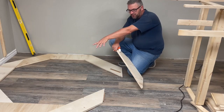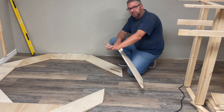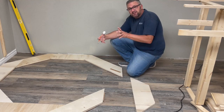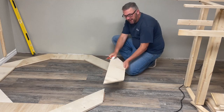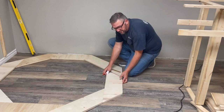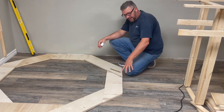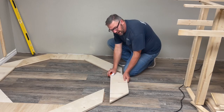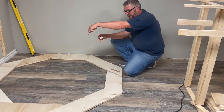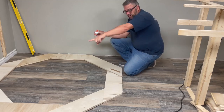I need to build one more full rotation. On the bottom connection, I've ripped the same width and dimensions — a piece of Masonite so that the entire bottom is double-lapped all the way around to create the support. Once I have my second layer built, I'm going to connect it. I need to do a double rotation of the helix, so I'm going to build and mimic everything I have here, connect it, glue and mount it, and that will give me my 30-inch helix. Then I'll set dead center and scribe my line with my little radius tool that I built to show my exact 30-inch radius.